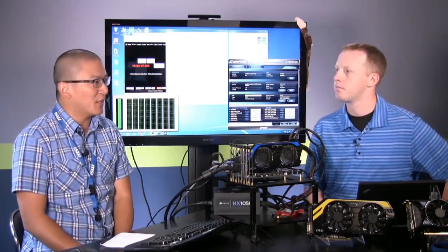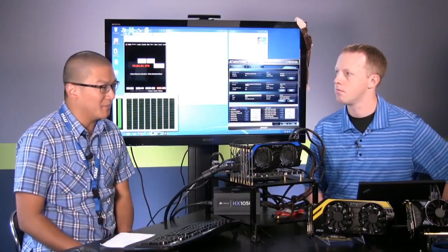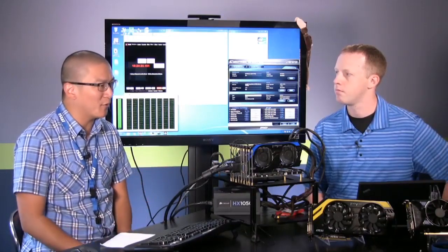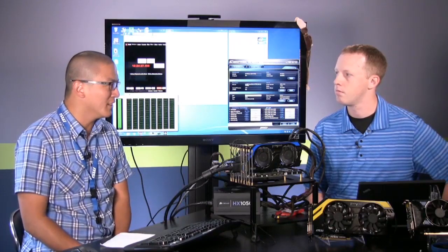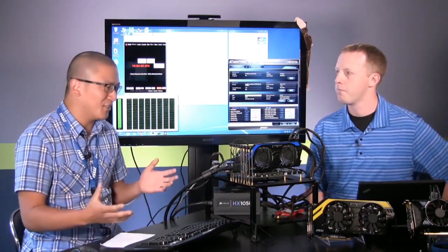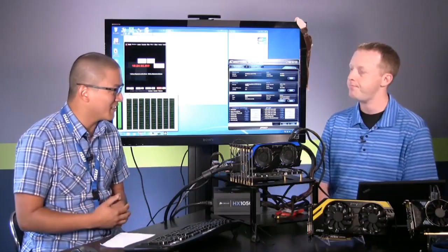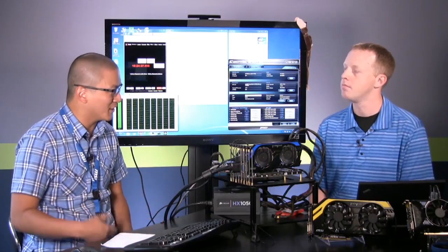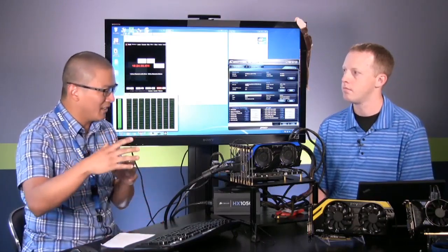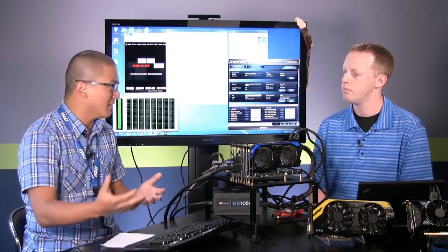Using the leads is pretty much every single board, but as far as an actual board being physically tested, maybe it depends on the factory. It could be anywhere from 1 in every 20 or 30 to upwards of 1 in every 50 to 100. It's all statistics. You basically run statistics analysis on your manufacturing process, right? And as long as everything is within the spec of the reference design, then we're good to go.